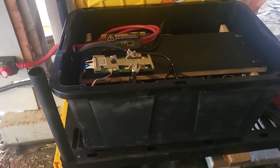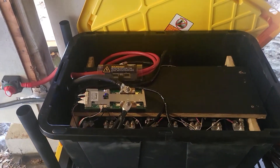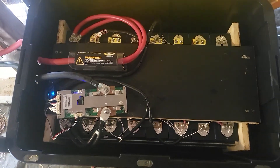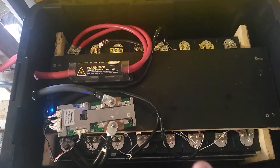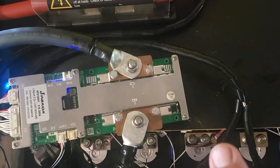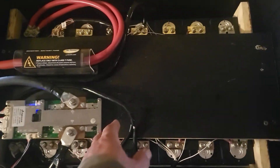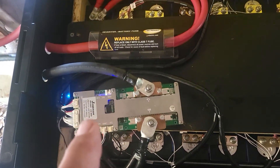Taking a closer look at the battery — I've got it mounted inside a storage crate, the type you can get at Home Depot or Costco. I think this is the 27-gallon one. These are EVE 280 amp-hour cells and there are 16 of them — they fit just that snugly in there. On the very bottom there is three-quarter-inch plywood, and I have three-quarter-inch ply on top for the BMS and the T-Class fuse. The EVE cells are the double-stud variety. I did drill the bus bars to install the BMS leads, which are wrapped in wire loom to clean it up, and I'm using the JBD 200-amp BMS.